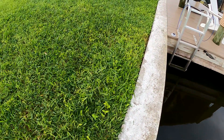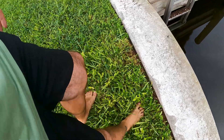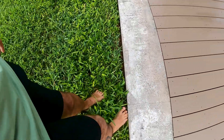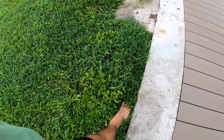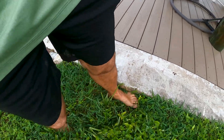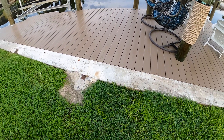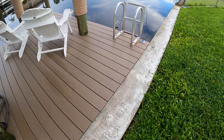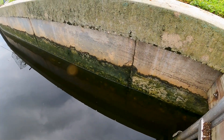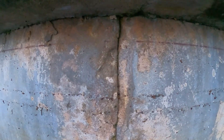You can see here where in some cases it's starting right there, in some cases it dips down. See like right here? We're losing some material. I'm going down this way. You can really see how much is missing. Here's a good example. So what we're going to do is we're going to need to fill this up with more material. Now there are places where they suggest that you put in barriers on the outside of the seawall so the erosion doesn't come through. What ends up happening is when the tide goes up and down, there's natural erosion where sand is seeping through these cracks between your seawall and coming out those seep holes.